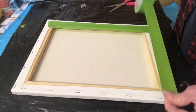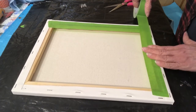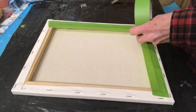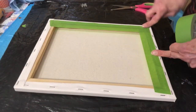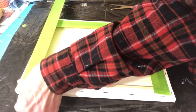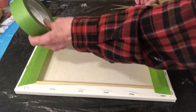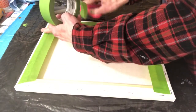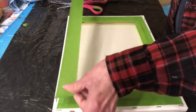I cut it at an angle — some people kind of square theirs, but I cut mine at an angle, sometimes more of an angle than the other. The main thing I do is when I get down here, instead of laying it all the way down because it'll stick to itself, I pull it up, bring it over a little bit, and then cut. So up here, bring it in a little ways, bring it down, stop it right there, rub it down so it'll stick good, then estimate where you want to cut, cut it, let it lay down. I turn them so I can get all four edges.